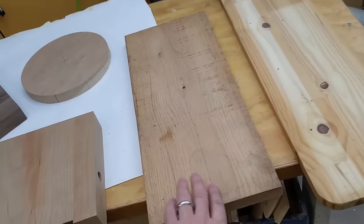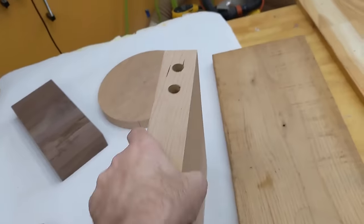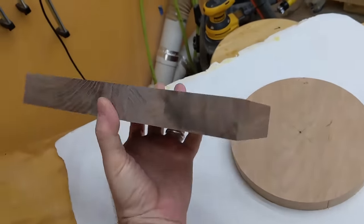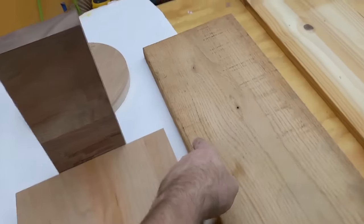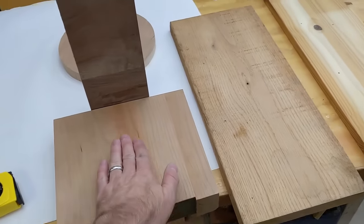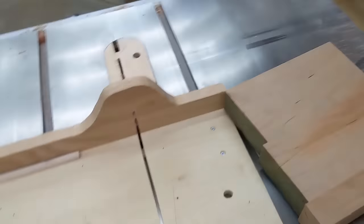I don't think I'm going to use the pine. I found this piece of wood in the basement and I think it's oak. I've got this chunk of cherry that's left over from a previous project with a couple of massive holes in it. So this was scrap wood, and I've also got this end grain walnut. My plan is to cut this into two shelves, put a dado there for one shelf and then another shelf above it, so that you can stack one, two laptops and maybe even a third. First, let's take this and square it up into a good size.